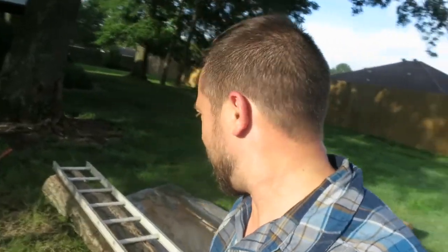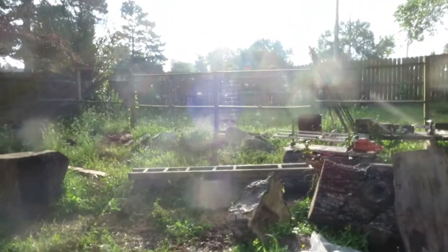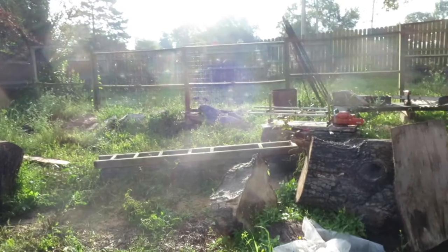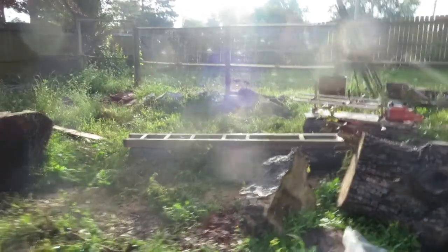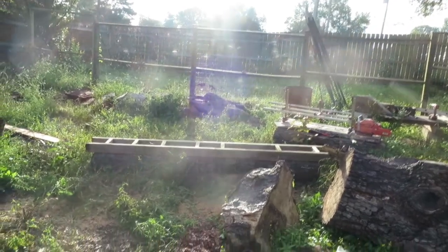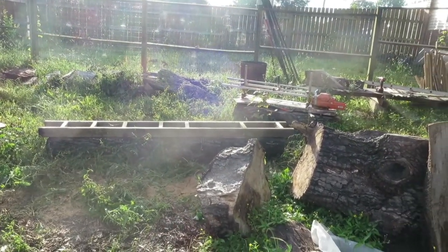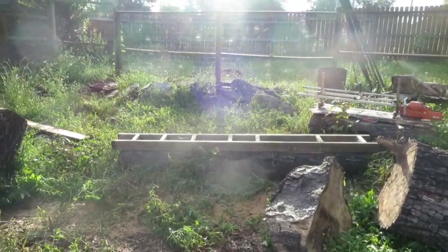All right, first cut is done. Cut really good. It didn't take long at all, maybe a minute and a half to blaze through that. But let's see what this first cut is on mine. Now, Luke is setting up the saw. There was a little bit of twist in his cut, so he is reestablishing. That would be the big thing. If you get a twist, don't keep going. Set up your saw and do it right. You want to get your best boards, so he's going to take a real thin cut off that and go from there. Let's look and see what's under this board.